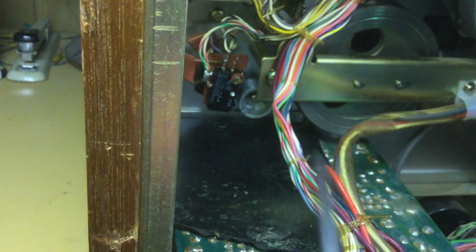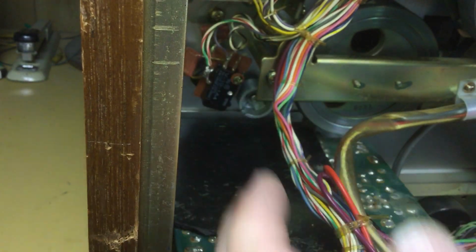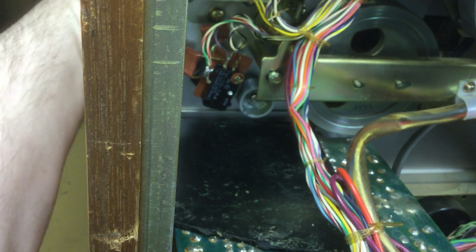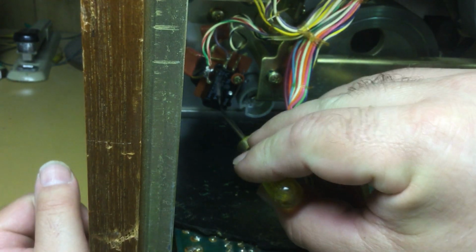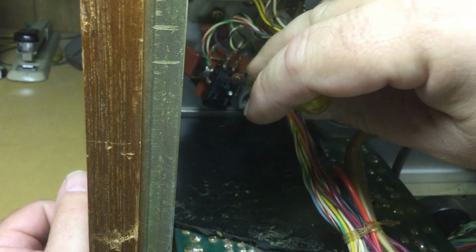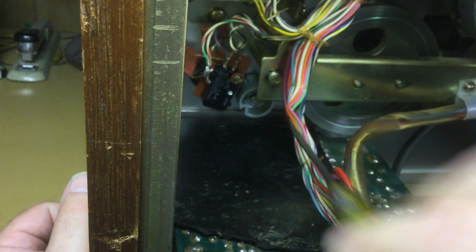Alright. Leave it loose. Don't connect the bottom yet until you get the spring hooked on, because you'll need to be able to move the lever all the way back around past the resting point in order to get the spring hooked on. And what I'm basically going to do now is fish the spring around to get to where it's laying on top of the cam.